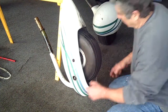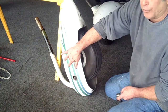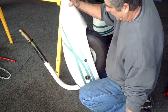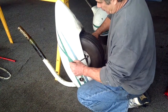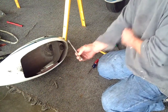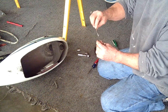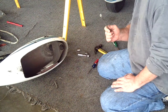Now let's go ahead and remove the front tire to begin disassembly. One side of this bolt is a threaded rod — it has two nuts on it. One's a nylock, the other one is a cotter pin. For the cotter pin side, I'll be holding it manually. We've gotten the tire out. As you can see, it's just a threaded rod on each end — one end has a cotter pin, and this end has the nylon castellated nut to hold it.